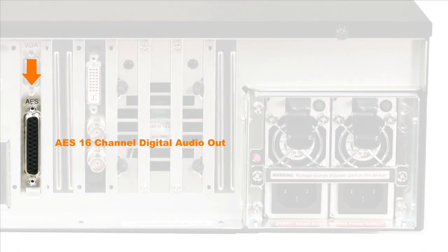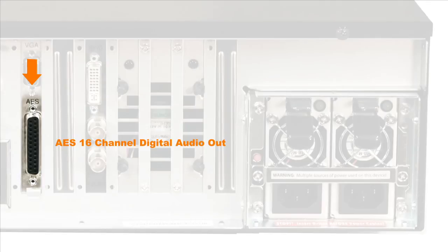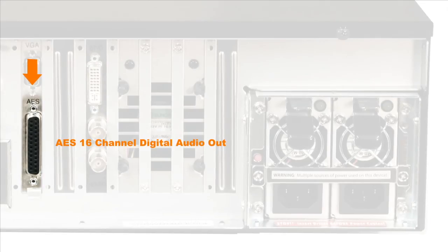AES 16-channel digital audio out. The digital audio interface of the Doremi server is provided on a female DB25 connector on the rear panel of the unit. 16 channels of balanced digital audio are provided through this connector.